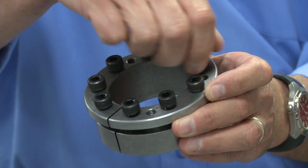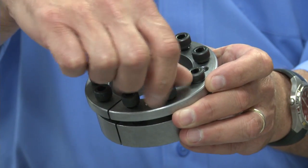The Climax keyless locking devices provide for generous fit clearances so that adjusting the drive element axially or timing it is relatively simple. Once everything is properly positioned, finger-tighten all the locking screws so that the heads are in contact with the face of the inner ring.